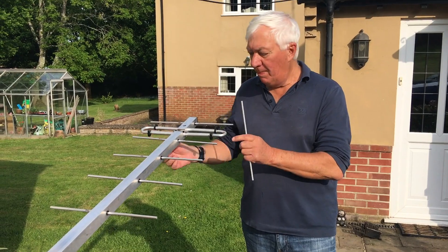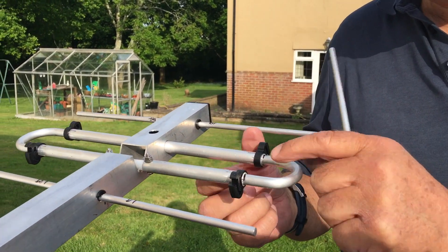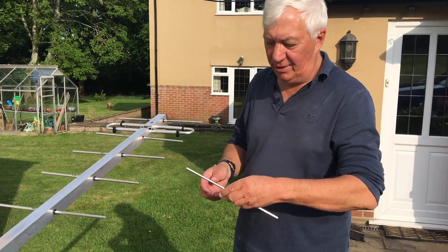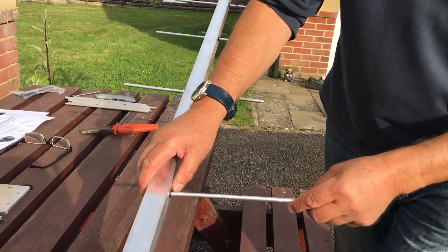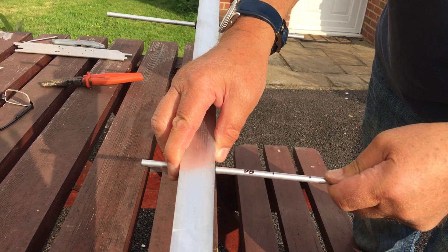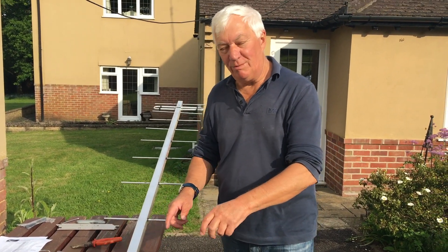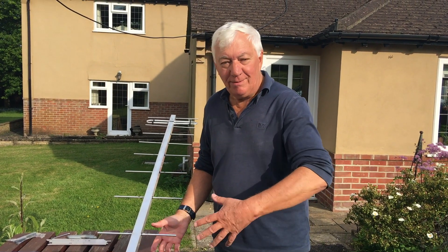So the driven element's all assembled. It's got marks on it at the moment for where it should be, but what we'll do later on is adjust that. These clamps here are not over tight, so I can still adjust that for a final adjustment, but it should be pretty well on the ball. I've got quite a few of the elements in, as you can see, and I'll just show you what you do to put the elements in. I quite like this system - it's very easy. There's just a friction fit there. You just give it a push, hold the other side, then just push the element through up to where the black marks are. Job done. Just to make sure they're secure, we'll put a dab of rubber seal or something else just to make sure they don't move, but they're pretty tight.